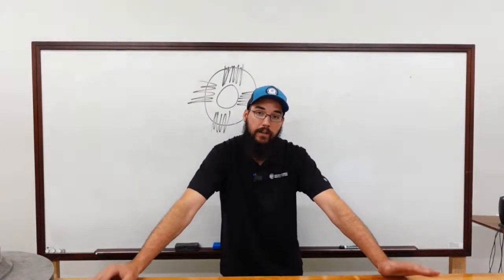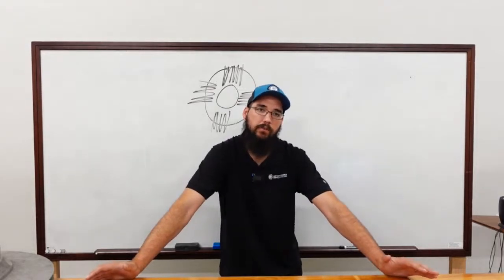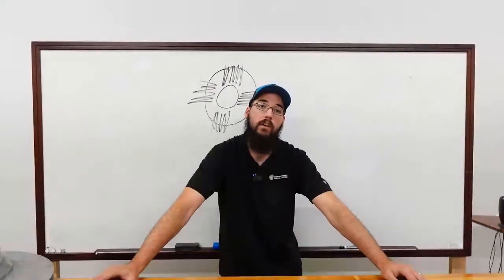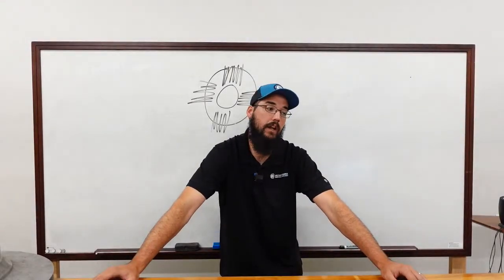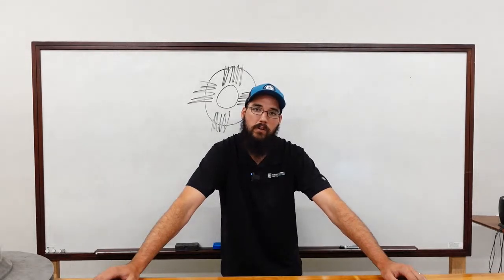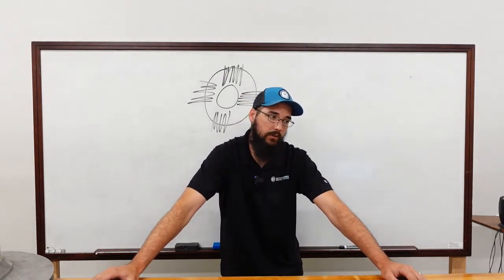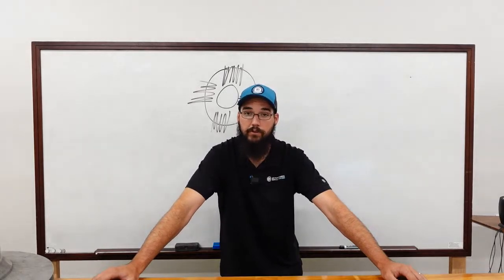So if we're talking like a Trane liquid level sensor, a lot of the times those are on the evaporator side. You could base that off of a couple of things, but the easiest would probably be to get a clear refrigerant hose and do a literal level check on the evaporator. You would go from the bottom port of the evaporator to one of the top ports of the evaporator. This is just like you were checking oil level on a separator or something. That would be one way you can see the literal liquid level of the refrigerant.